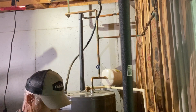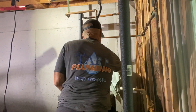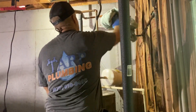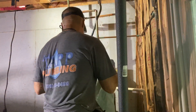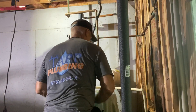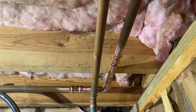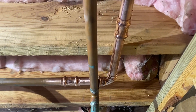Tip number four is to get everything really dried up as quick as you can. That way, if you find new moisture after your test, you'll know there's a problem you have to hunt down and correct. Here's the finished product — if you look really close, you can see where I shoved a little piece of sheet rubber in between these joints to keep this from happening again in the future.